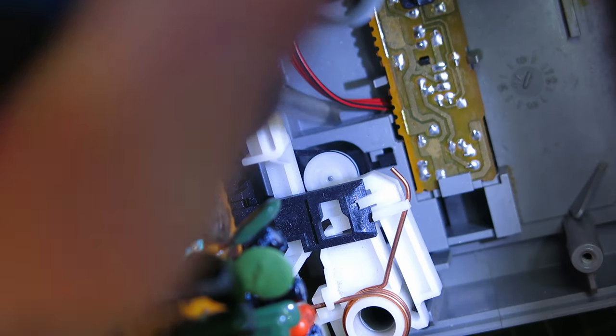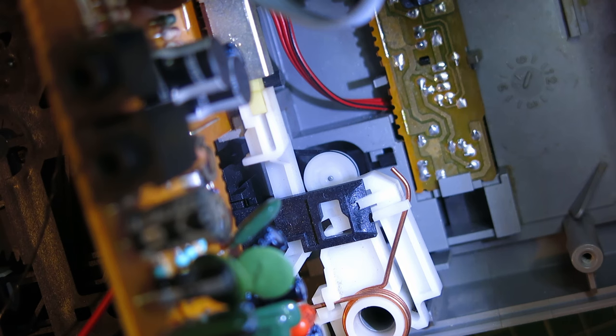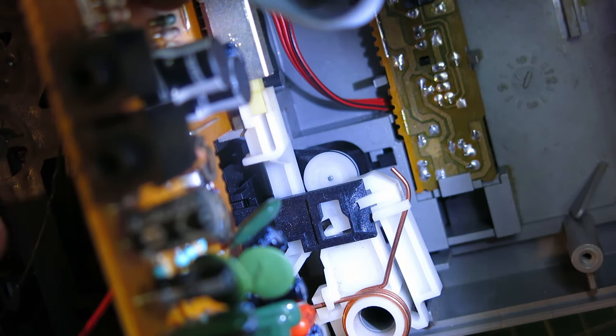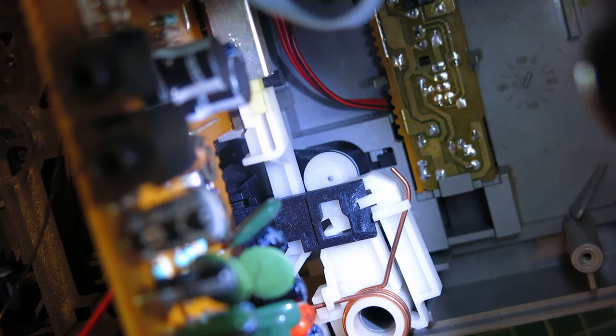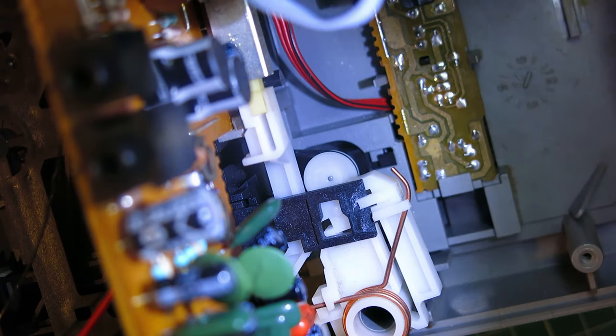So I'm going to pop this one on. That's the new one in. Just checked it with a little inspection mirror — it all looks parallel to me. The mounting on these should be fairly standard. I'll double-check it with a scrap tape just to make sure the alignment's okay when the head block comes up. You see the plastic pulley right down the middle of the shot — that's the tape counter pulley. The belt goes around that and then around the supply shaft on the tape mechanism. In order to fit that belt, you need a metric ton of profanity. It's an absolute nightmare.